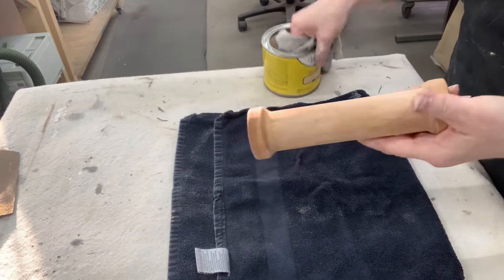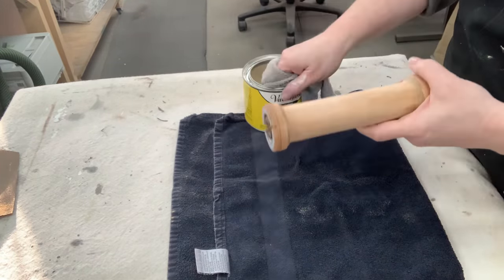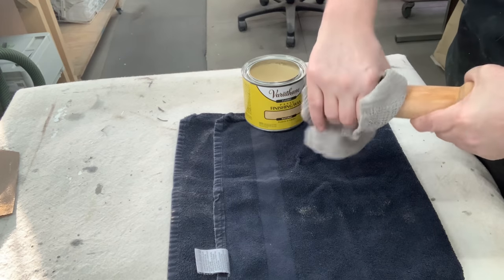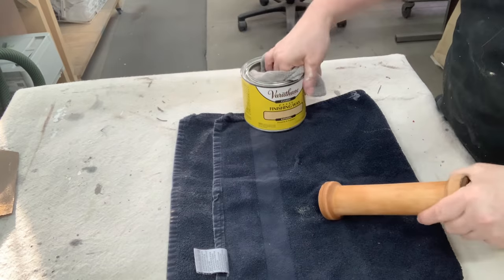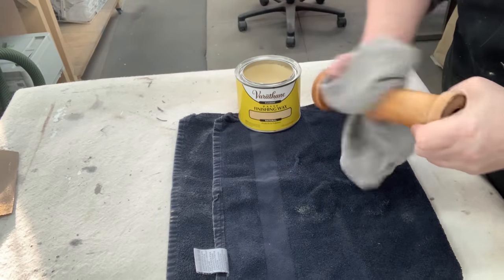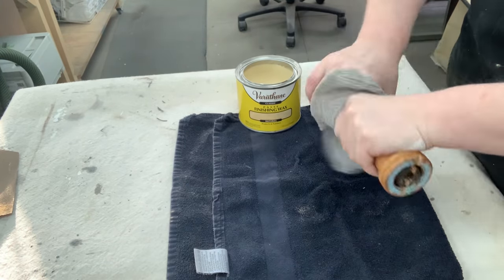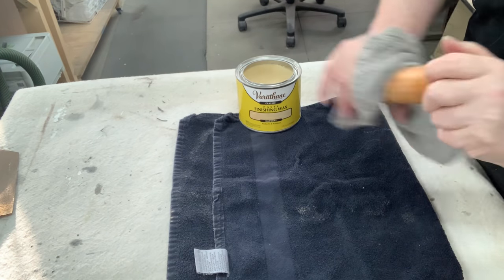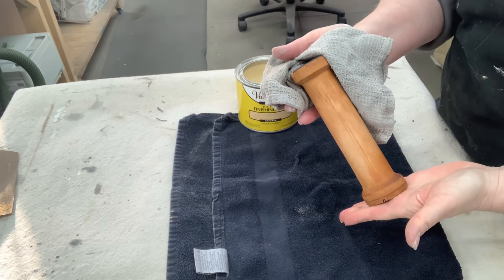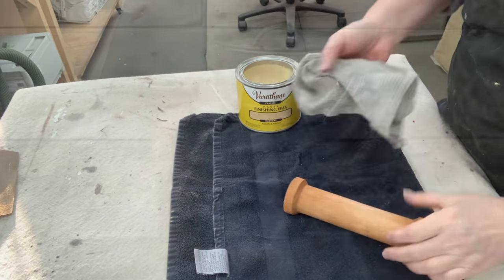Yep, it's going to have a little bit different patina. There's just something about the way an item ages, but I am going to try to get a little bit of that patina back using some of the Varathane clear wax. I'm not going to mess with antiquing wax or anything like that because of the painted ends. I want to leave it as is, and hopefully it will age again over time, but I do like it a little bit better without the wood burning on it.